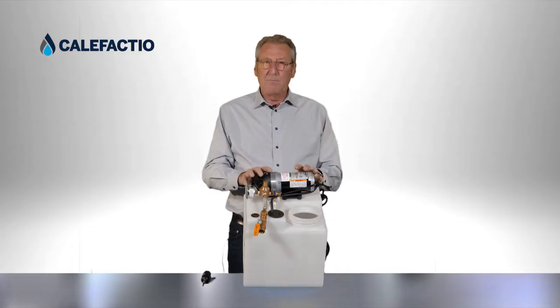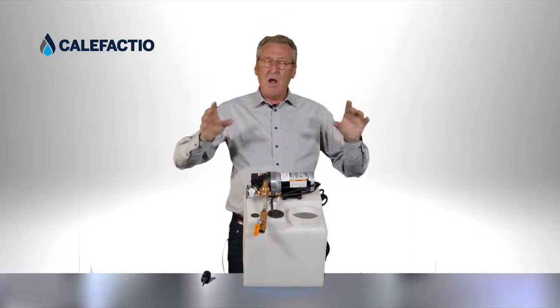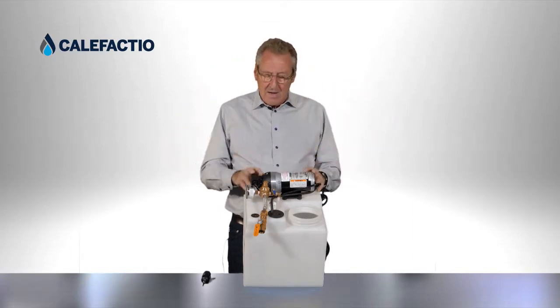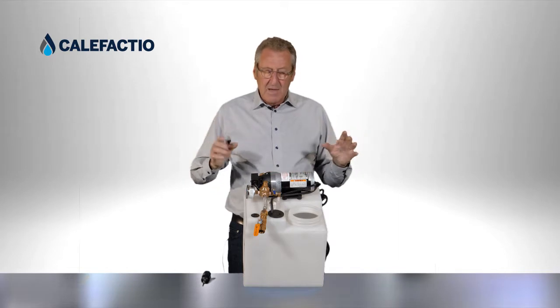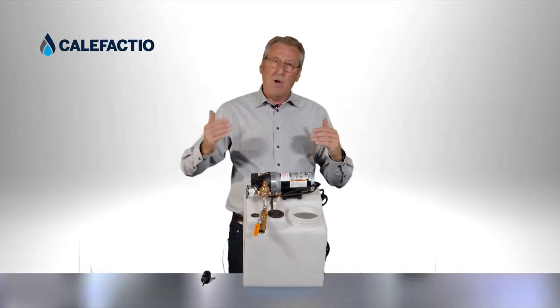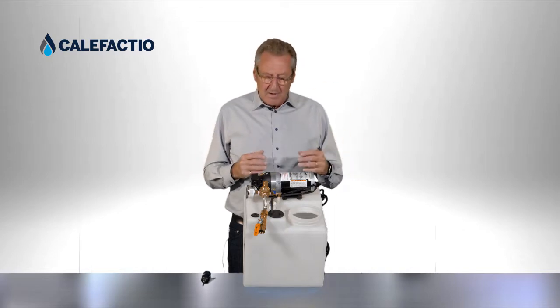The reason why the pump does a stop-and-go is because there's air trapped in the system — in elbows and valves and whatever is in the system — and that air is going out slowly through the air separators or small air vents that are installed.